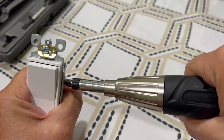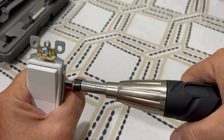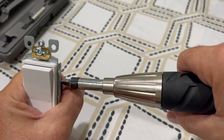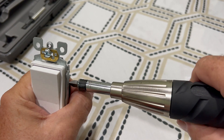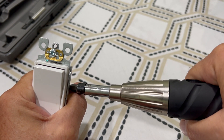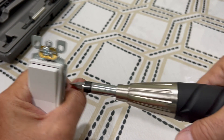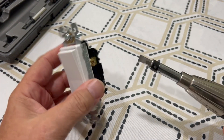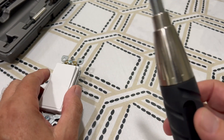You ready? I'm going to do it again. You see? This part didn't turn, this part did. It's at 14 inch-pounds — so what does it do? It just goes ahead and rotates. So this is torqued to 14 pounds. That's how you use the torque screwdriver.